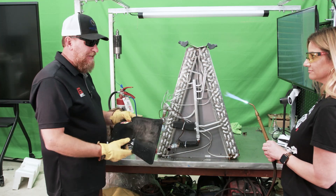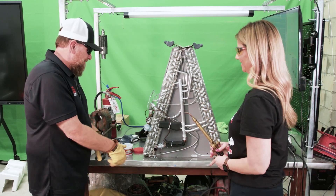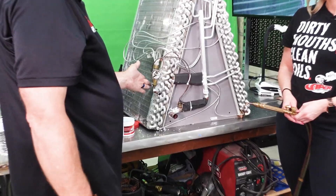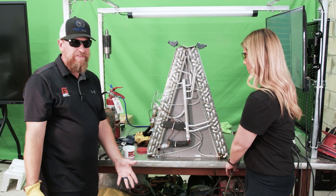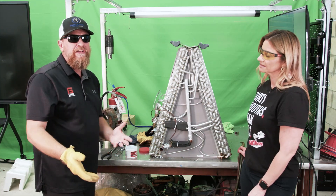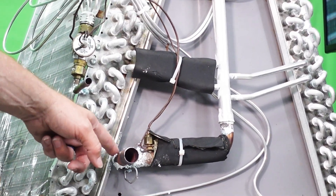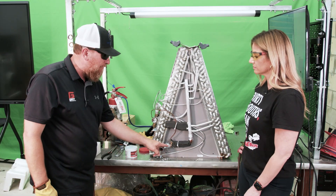Here we have our TXV nice and protected. Over here this is still cool to touch. If it's cool to touch, we know that all the pieces inside are protected. What I like about this versus a wet rag is that a wet rag is leaking and dripping water all over the customer's floor, and at these connections the steam affects your flame. That steam can get inside, and if it's POE oil, that POE oil can turn to an acid which you can't pull out with a vacuum pump. So we're protecting it — it's nice and clean.